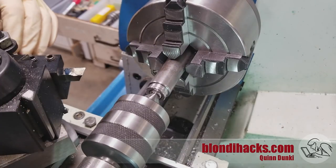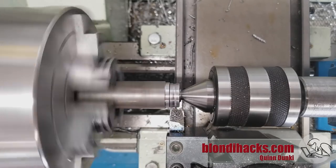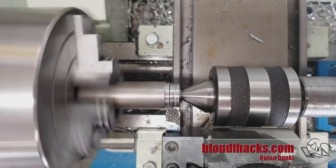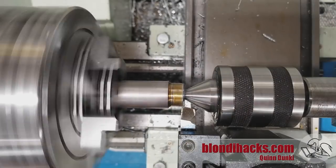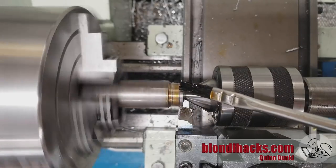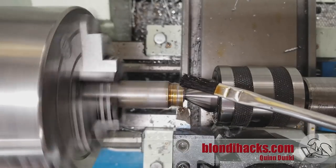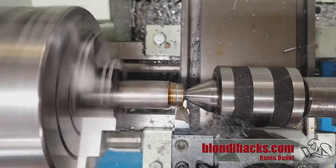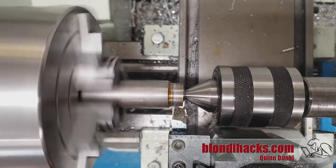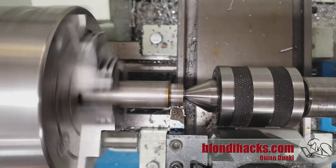This arbor is sacrificial mild steel, so I go ahead and machine myself some runout area for the next step. Now I can start machining down the OD of the bearing. I'm taking very light passes because it's only held there with super glue, and I'm using a lot of cutting fluid. That's really important because the enemy of all glue is heat — it's crucial that this part not get too warm. If it gets too warm the glue is going to break loose and all bets are off. So I'm machining very gently: light passes, lots of cutting fluid, keep that temperature down.